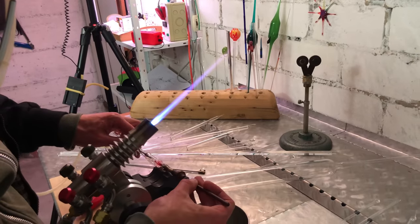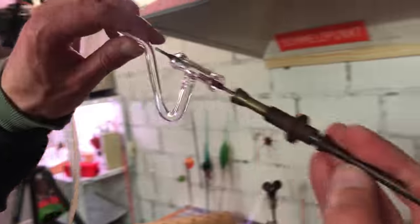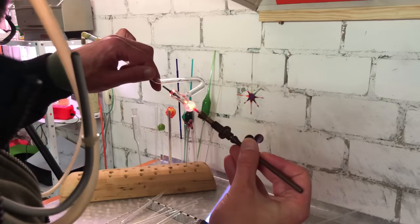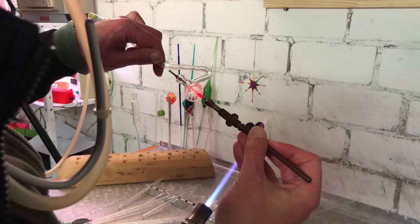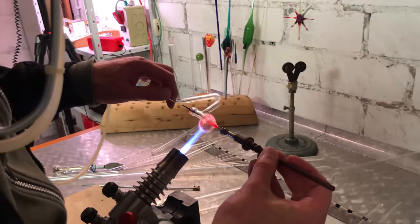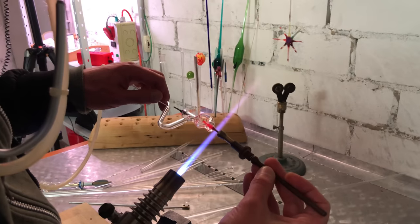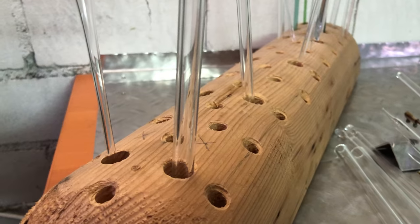The second electrode was then attached to the opposite side. Unfortunately, the tungsten came into contact with the side of the glass tube and formed a sharp edge. These sharp edges are stress raisers that promote the formation of cracks in the glass. I probably would have just said good enough and hoped, but Johan couldn't live with it. The inside diameter of the tube was too small to fit the tungsten electrodes. We could have tried a dozen times and eventually it would have worked, but we decided to use a larger diameter tube instead.